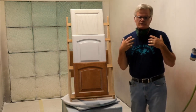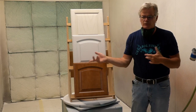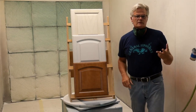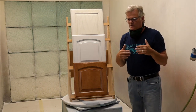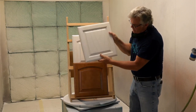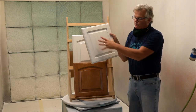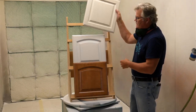I would always follow my instincts and think if I look like I can get it done with one. I have a maple door here that has one primer on it, and I'll show you. But normally, if you're going over existing finishes, usually 2 coats. Because 2 coats builds your protective layer, but also allows for it if the first coat you didn't get 100%, and this is a good example, down inside the grooves here, or where the door frame panel meets, it needs another coat to cover up that area. Because when that door shrinks, you're going to get that color line from not having enough primer on.